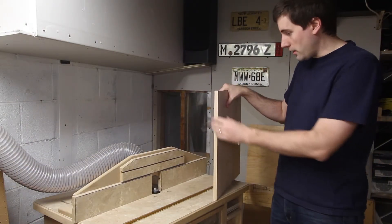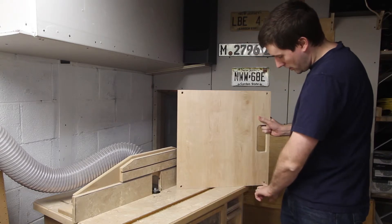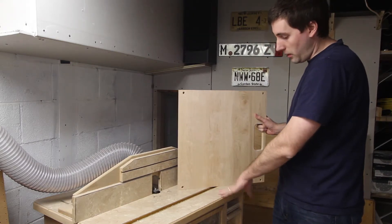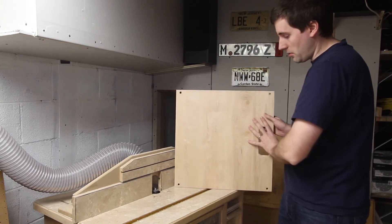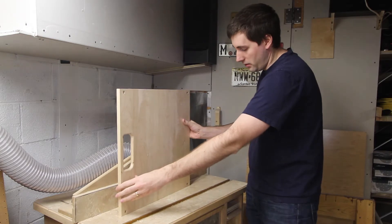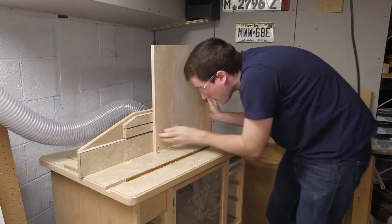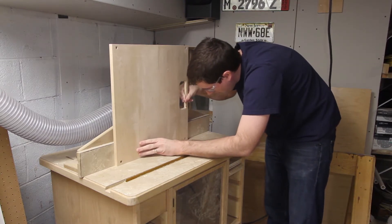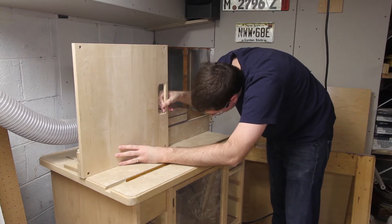I've got the router table set up here to cut the slots in the ends of the box for the plywood, so it's going to run from here to here. I've got it set up with a slot cutting bit — it's only a 1/8-inch slot cutting bit, and the plywood is 0.2047 inches thick, so I'll have to make two passes raising it in between. I have to drop it in because I don't want the slot to come out the end, so I'll drop it in, run it down, and pull it out before getting through. I ran into an issue where the dust collection actually sucked the board into the bit, so I had to be very careful dropping it in. But once it was on there, it held it up nice and perpendicular with that suction, so that worked out pretty well.